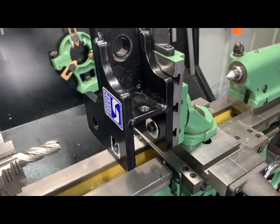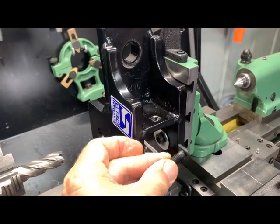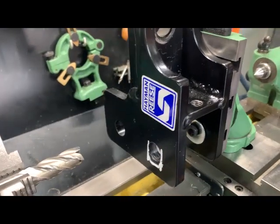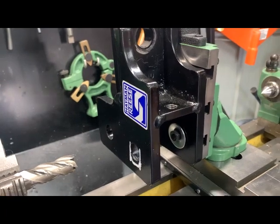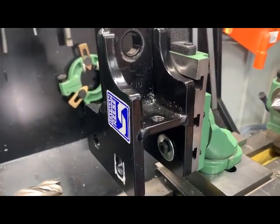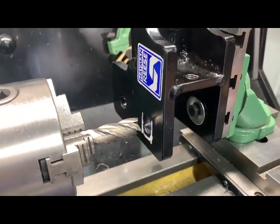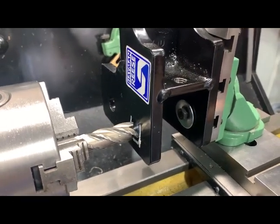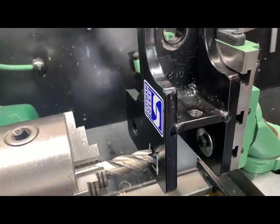Okay, so there she is clamped into place. You use these little T-bolts — they go into those slots there. So I've got two of those T-bolts and the next job will be to actually line the device up, or the tow hitch part, with my boring bit. I've actually got a bit that's slightly smaller deliberately so it makes it easy for me to centralize it and get it set into the correct position.